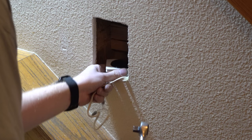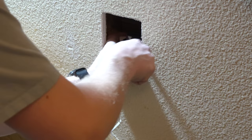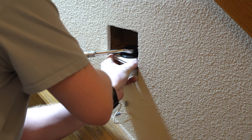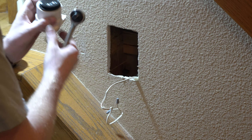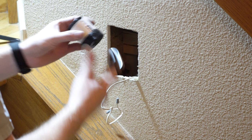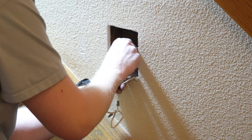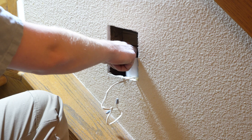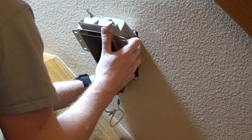We've taken the frame out of the wall, and now it's time to use the cutter. Looks like that has done its job — really fantastic. You can see the blades sticking up there, but the blades don't cut you. Now we're going to reach in, grab the pipe and see what kind of mess that left. I did get a burr on there, unfortunately, but the good thing about working with PVC is you can just clean that up quickly with a blade. Now this guy just kind of goes in its place.